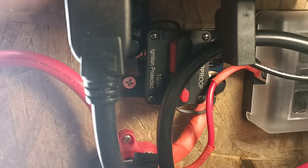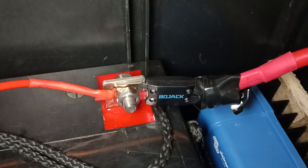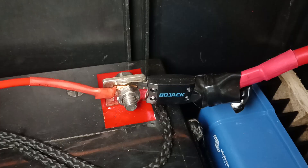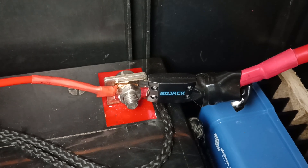Just like Fishing and Stuff's build, this inverter runs through a 100 amp circuit breaker and there's also a separate 125 amp fuse on the battery. I'm not an electrician and I approximated these safety measures, so let me know if you think I can make improvements here.